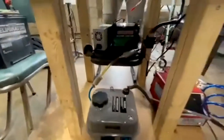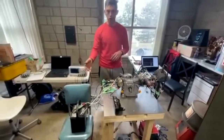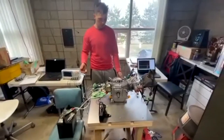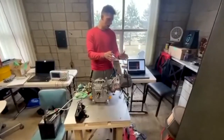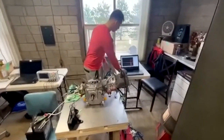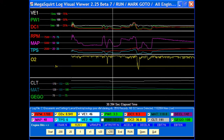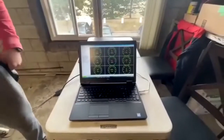You'll also see the fuel system and the individual battery to power the EFI system. On a separate battery, we are using that to turn the starter and the starter key so that there's no voltage drop during operation for the Ecotron system. All the data and all the sensors are communicated through to the laptop, which can be seen over here in live operation. Every single line identifies a parameter that we can see, and in EasyView we have gauges to identify our main parameters.